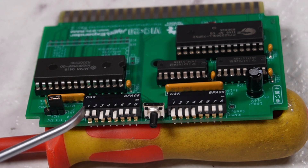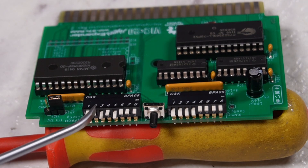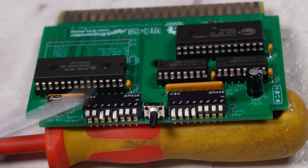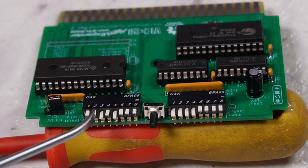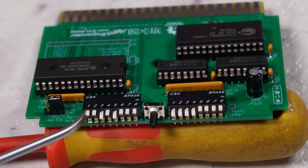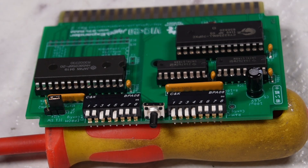The 58C256 is only a 32K EEPROM, so it only has four 8K software images in it. If I had a 27512 then I could have the full eight images, and in that case these address lines would be as normal. But the documentation covers all of that. So with those settings established, let's grab the VIC-20, plug it in, and see what happens.